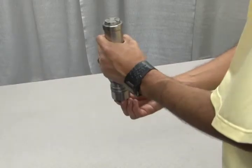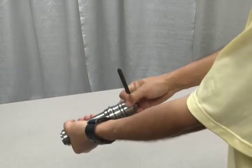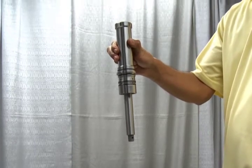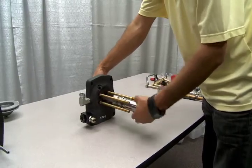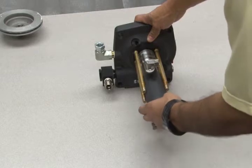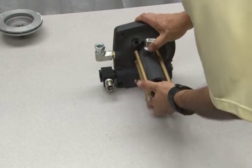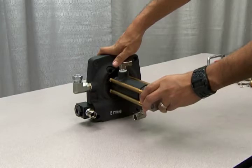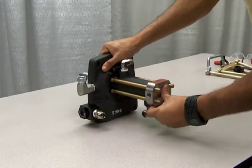Pull the bottom of the piston rod out three quarters of the way to prepare for reinsertion. Using a bench vise makes this process much easier. This is the proper position for the piston for reassembly into the gas drive section. Next, insert the gas barrel into the casting. Now use the cooling sleeve to help push the piston into proper position. These parts should snap into place. Insert the resealed gas end cap onto the four tie rods.